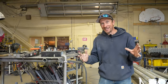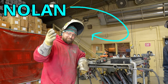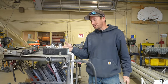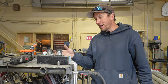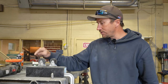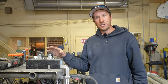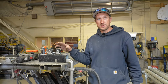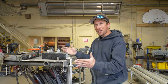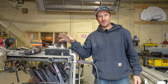We have an awesome idea to show you today. This right here is Nolan. This is just a piece of scrap 3x3 tube we had laying around. Nolan purchased a couple casters without the swivel — just a straight mount — and he welded them to the piece of steel here, creating a positioner. He's working on welding base plates to 4-inch galvanized posts for a fence that's going to get installed on top of a concrete slab inside a building. We're going to show you how he uses his idea and how efficient it is.